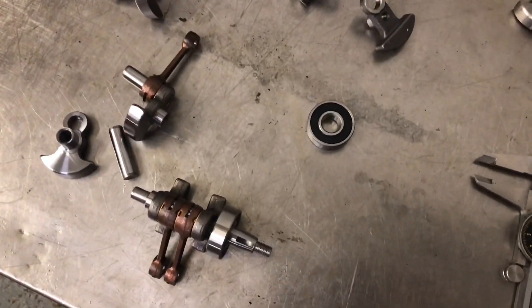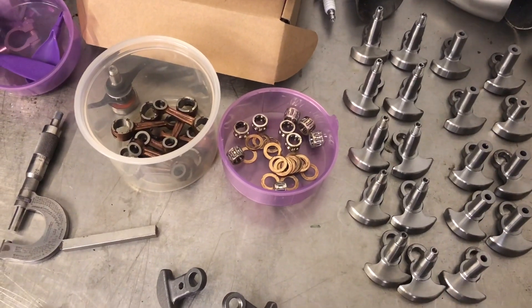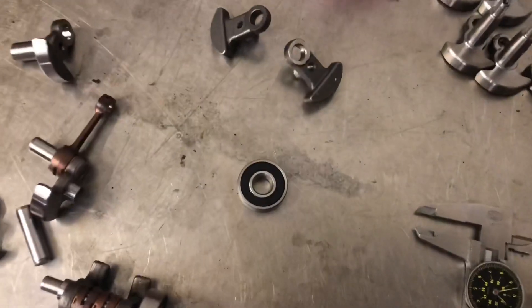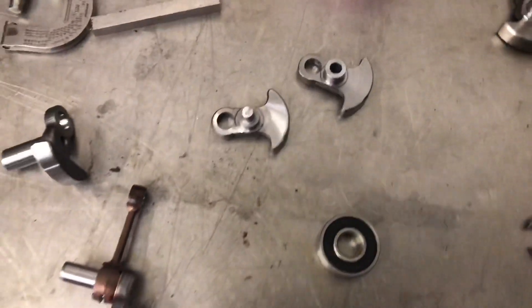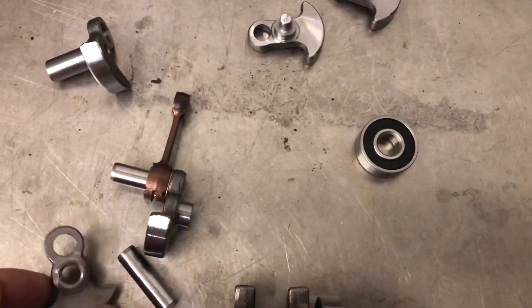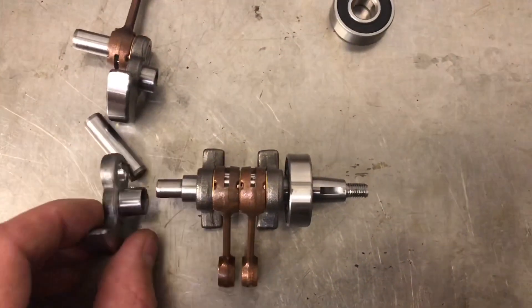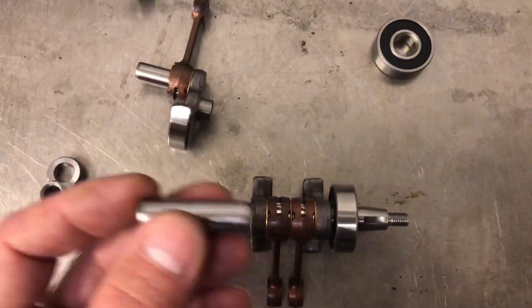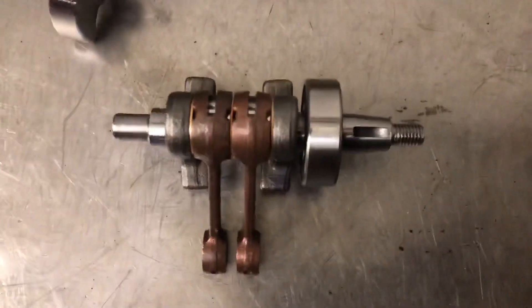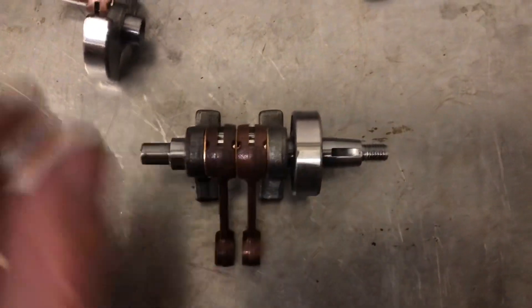Here are some crank pieces — I'm obviously not going to use all of these blades, but I needed to strip them down to get all the con-rods, bearings, and washers. My original pin spigot press-fit approach — I'm still moving along those lines, and I'm up to an 8mm pin interference fit with this part of the crank. These pins are for the con-rods; they're a bit longer than the original pins so I can get two con-rods on each journal. These main bearings are a little bit bigger than the originals — 12mm wide instead of 10mm, and I think they're 26mm diameter, just a little bit more heavy duty.